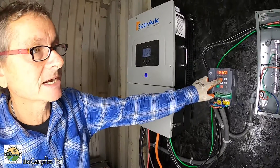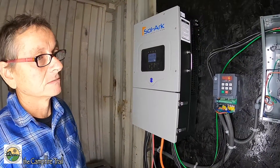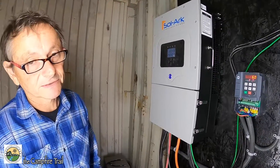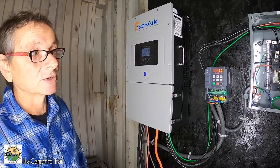You also have to keep in mind you can't run a pump too slow, because the pump actually uses the water to help cool the motor itself. So it's a fine line. 50 hertz is okay, probably 45 is okay. You're going to come to a point where nothing is coming out — that's definitely not good. You need to have water flowing through that pump motor to cool it.